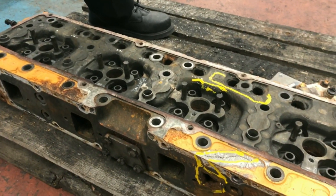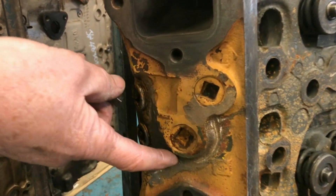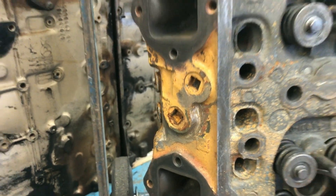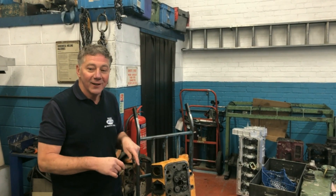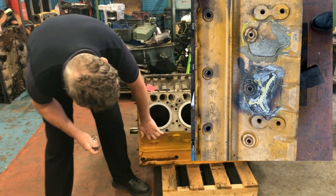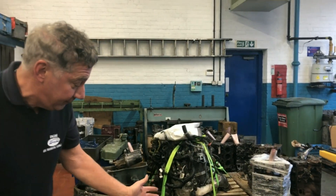If we have a look at the part of the head that's done, you can see the finish. Once it's all done, the studs are all peened over and you can't really tell the stitching's been done — that's how neat a job it is. We did that head several times, because once you've sealed the cracks that are leaking, some other cracks appear. In that head alone there are around 175 studs. All this area has been put back together with a mixture of brazing and stitching, and you can't tell from outside. Hopefully it'll run forever now.